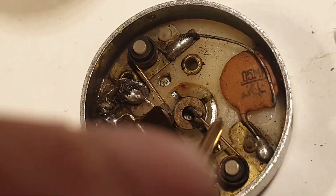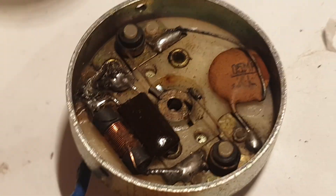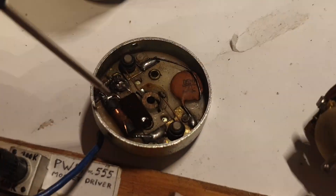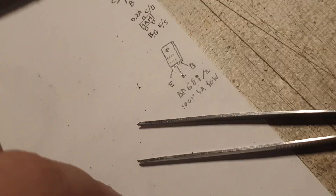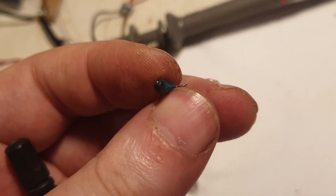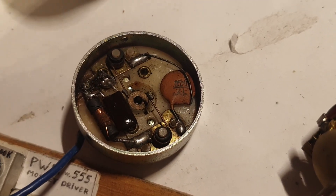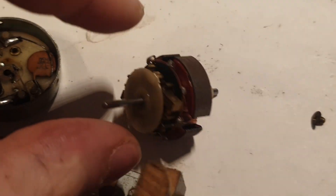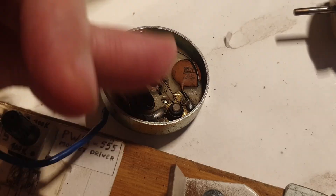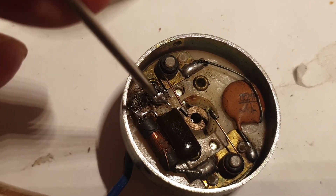Here is the commutator, which I should clean a bit, and the cap holding a tiny bit of circuitry. This is one brush and another brush — you can see how eaten they both are, nearly reaching the metal, but still having a tiny bit of material left. Before the new capacitor you see here, there was a tantalum capacitor, which is polarized with positive and negative. That's where it burned — some smoke came out, the plastic beneath got burned, showing me exactly which component failed.